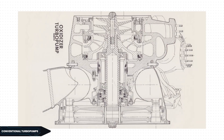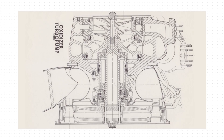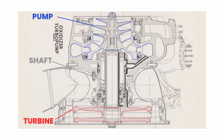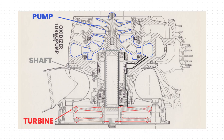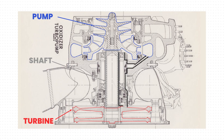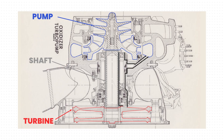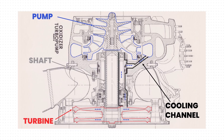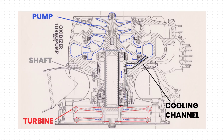When you have the concept from turbofan engines laid out, you might think you could apply it to a turbopump of a rocket engine, which is in principle a good approach. Here you can see a schematic of the Saturn V J2 engine turbopump from an original NASA document. The pump section is located at the top with main components colored in blue. The turbine stage is at the bottom with the blade assembly marked in red, connected via the gray-colored shaft. In turbopumps, a small fraction of the pump flow is already separated for cooling purposes, such as to cool the bearings. It is relatively easy to extend this idea and route some of the fluid to the bottom turbine region and through the turbine blades as well, as shown in the animation.